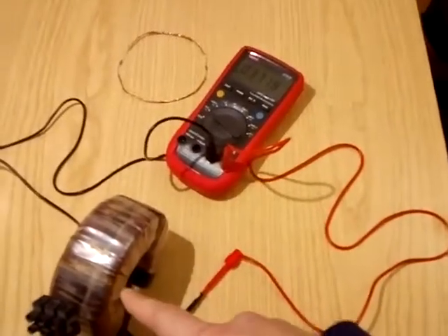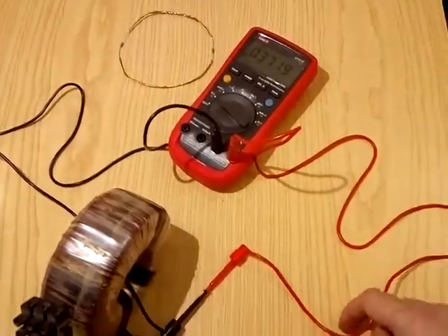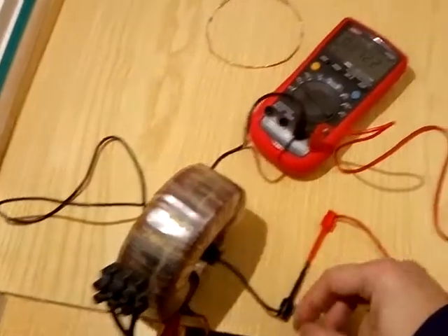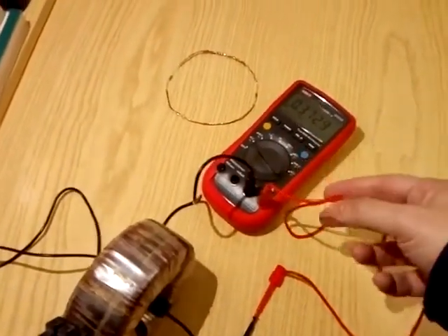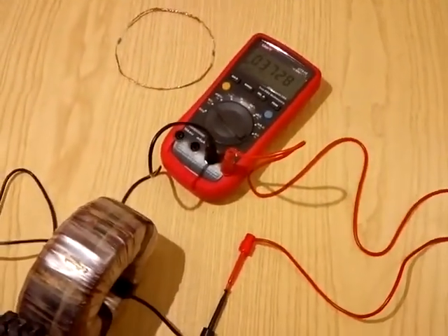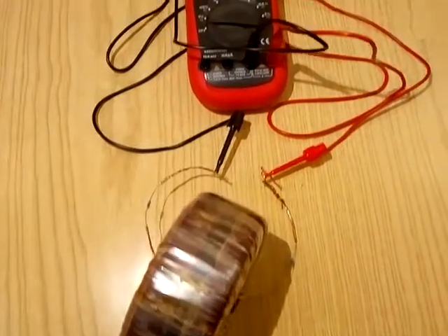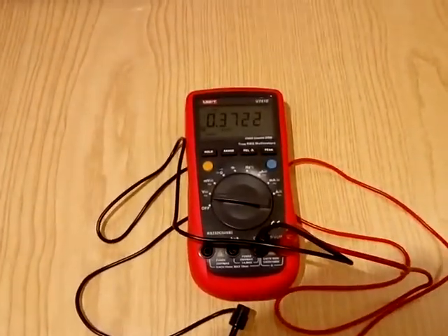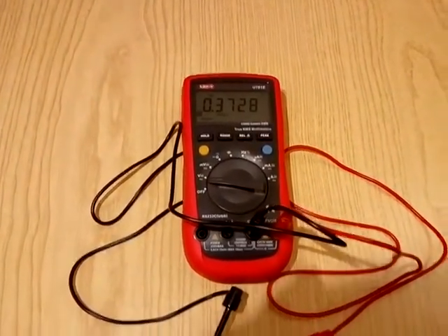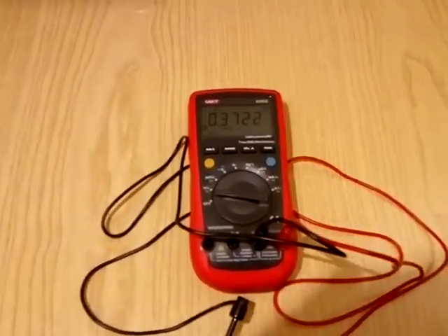Toroidal transformer — 372 millivolts of EMF. We can measure it by running the probes around the core. You might say this is the secondary of a transformer and the internal resistance of the voltmeter is the load. That's kind of right. This is what I measure when I open the ring — all the voltage falls across the internal resistance of the voltmeter. That's the bigger one; almost all the EMF is there.